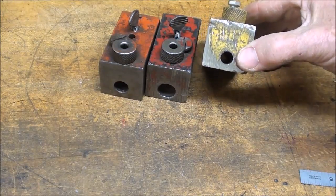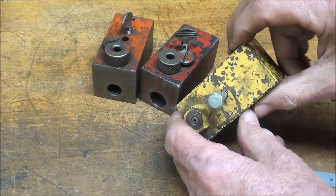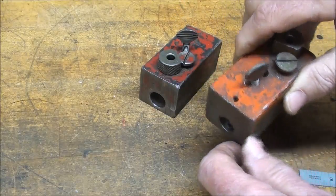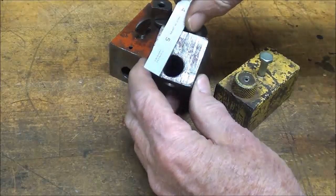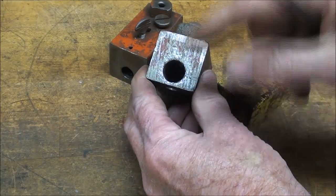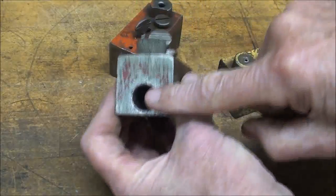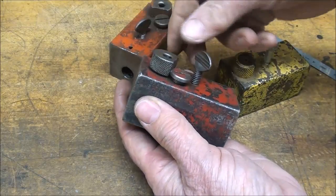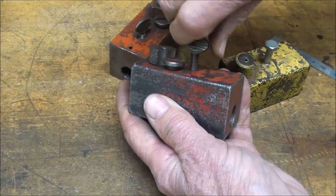I made these jigs in several different sizes — there's a three-eighths hole, a half, and a five-eighths, and the bushings can be removed. Years ago at school I had made some of these just out of soft steel and didn't even use a bushing — it just had holes in there. Eventually those wallowed out and were inaccurate, but still so much more accurate than drilling freehand. The bushings here are replaceable. The stock is nothing more than inch-and-a-half hot rolled. The hole should be drilled farther toward the bottom so that you have room for the bushing. These are about three inches long. That hole would be drilled in a four-jaw chuck in the lathe so that it's accurate. These were just reamed holes with the bushing held in place by that shoulder bolt. There was also a hole here with a thumb screw to hold the work down.